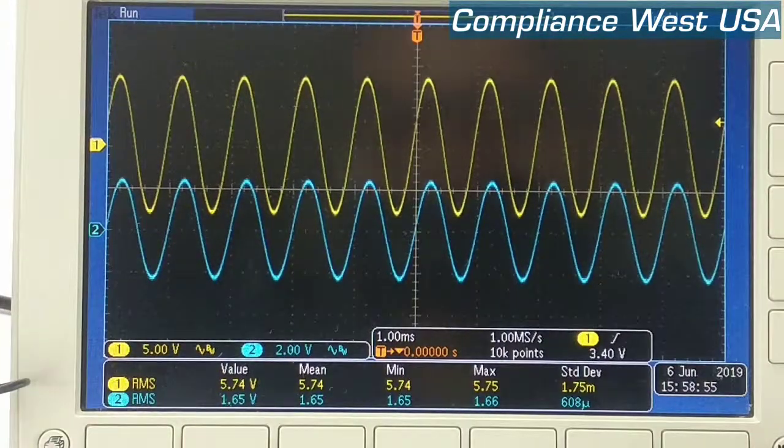Those values — if you divide the output by the input, you're going to get the ratio, and you can cross-reference it with the calibration data that was provided with your LCB. This way you can verify that it's properly calibrated and working as intended.